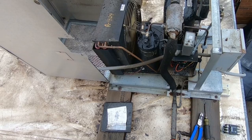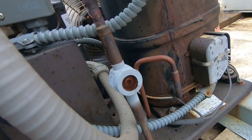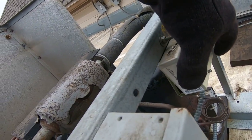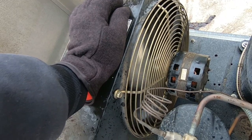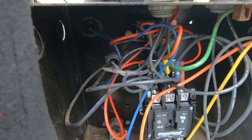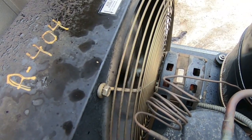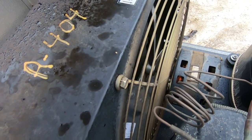See whether the pressure switches kick on — there goes the fan, that's a good sign. Sight glass seems to be clear from what I can see from here — it's so nasty looking it's hard to tell. Get this back on. That fan doesn't sound quite right — seems a little quiet. Comes in on the blue — just picked up speed. That's not good. Either we've got an issue with that fan motor, which I'm pretty sure I don't have one. Either way, it probably should be replaced.